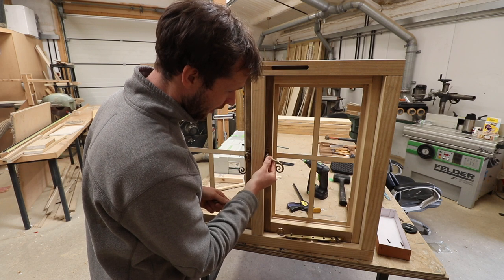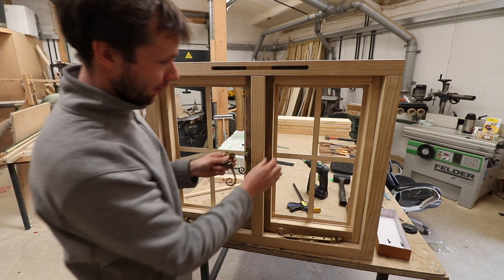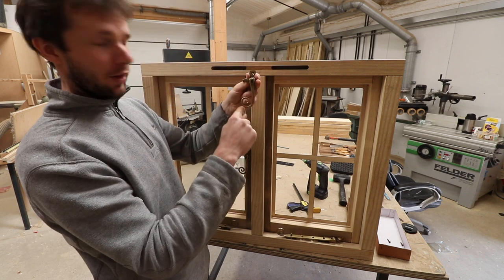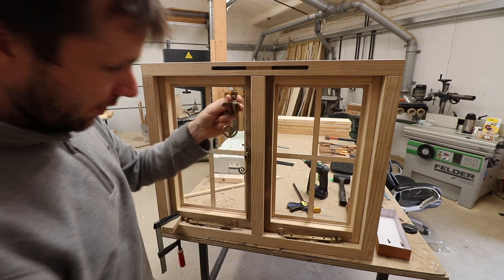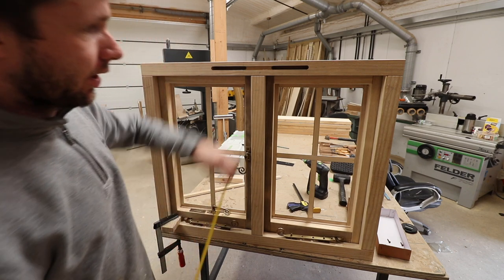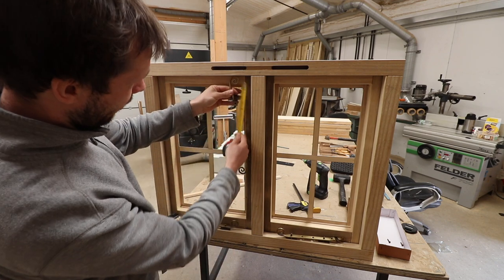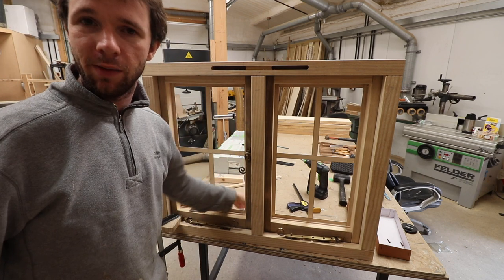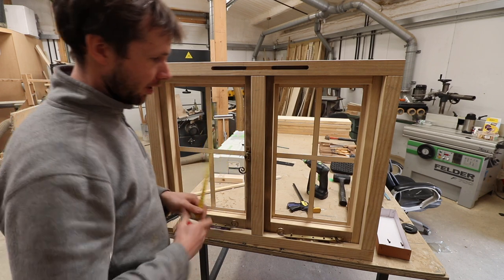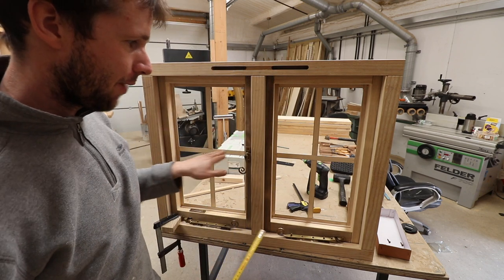You've got to have enough room on the window to fit the fastener. Before we get started on where to fit it on the casement, we need to work out where we're going to put it in terms of height. Generally I put it so that the distance between the bottom of the monkey tail to the sill is the same as from the top of the fitting to the head. The easiest way of doing that is to measure the overall opening — which is 670mm in this case — then measure the height of the fastener, which is 110mm. So 670 minus 110 is 560mm, meaning 280mm from the top of the head to the top of the fastener.